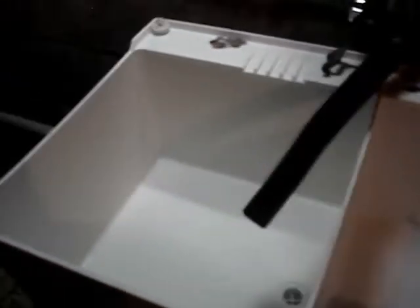The reason why I stuck with the double bowl is for safety reasons. What if you had a single bowl laundry tub and the drain got clogged, and the water level got so high that the water spilled onto the basement floor, either causing a basement flood or major puddles on your basement floor. With the double bowl, it has this divider right here and the divider is kind of concaved, so if the water level gets too high the excess water will spill into the other bowl, preventing flooding to your basement or major puddles on your basement floor. And yes, I got this tub for safety reasons because of that.